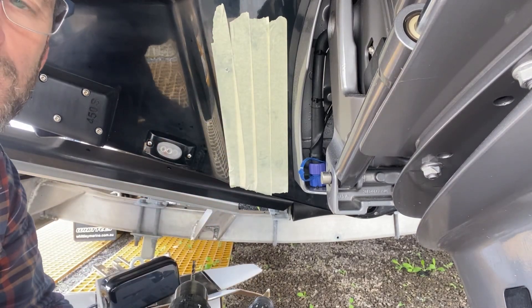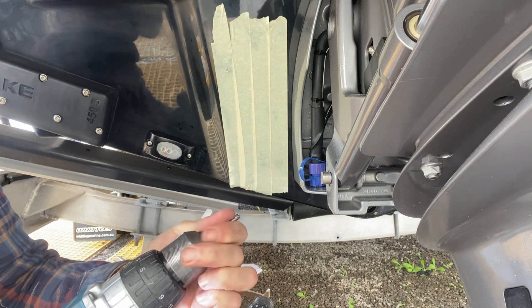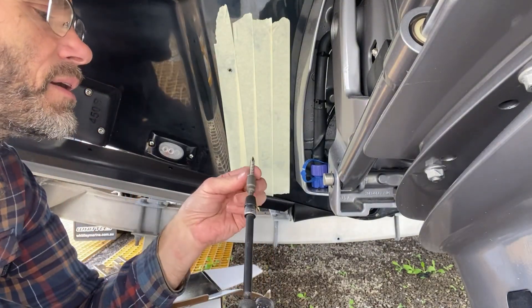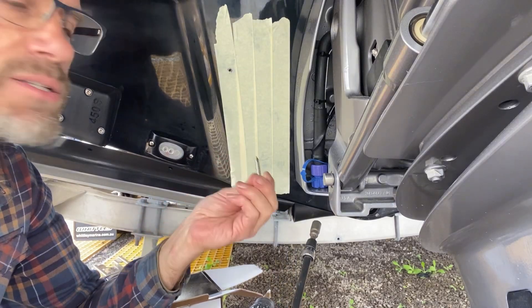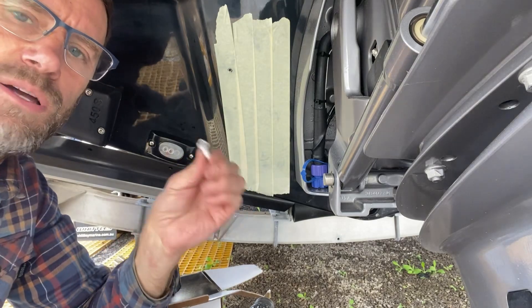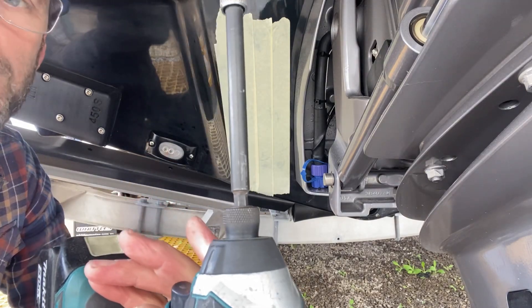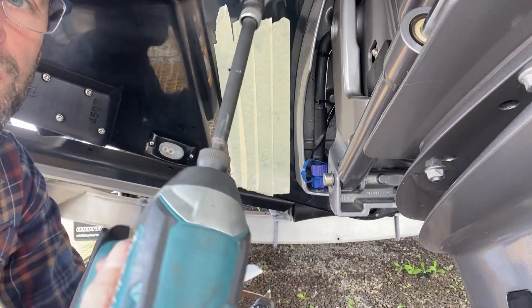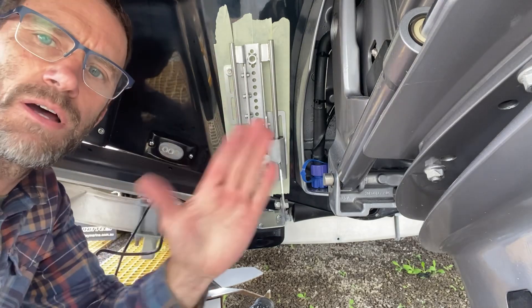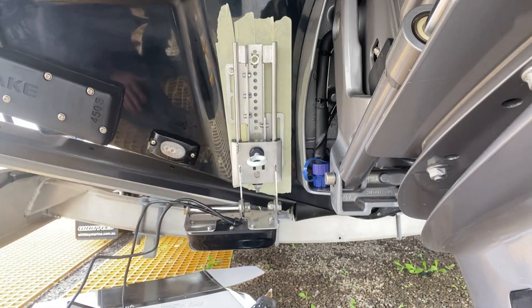Let's drill the hole for the first screw. I want to set my depth so I don't go any deeper than the screw itself — set the drill bit at that height. It's also good to pre-tap the hole with a mild steel screw of the same size so there's a thread waiting, but I'm not going to do that here. Be really careful with a power driver because if it gets hot it will snap; better to use a socket wrench if you're not experienced. Once the first hole is done, I go out and sight it to confirm it's straight and level.